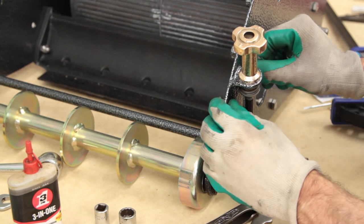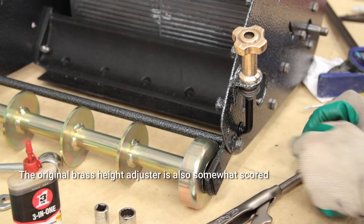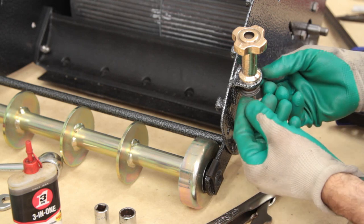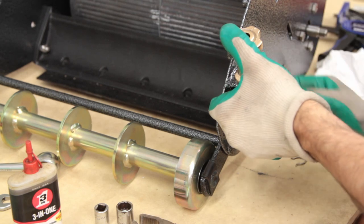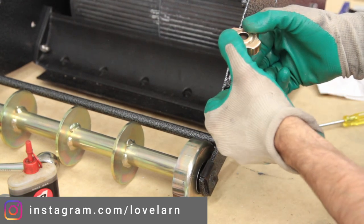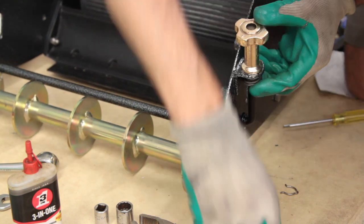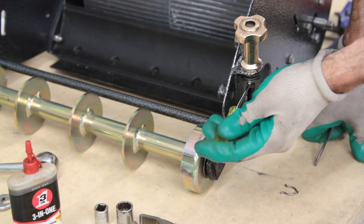I've tried to get them up in place — there's not a lot of wiggle room on the inside of this L-bracket, mainly due to a little bit of paint or metal sticking out. But basically I've got that retaining washer sitting in the little recess for the clip. The challenge now is to get that spring raised up — and the whole washer — enough to get the clip started. If you have a helper available, this might be a good time to call them in, as you can use your fingers to get the spring up and the clip started. What I've done is lifted that spring up a touch and popped a flat-headed screwdriver in there for now.